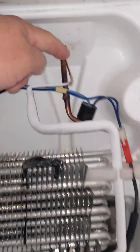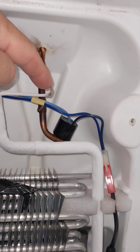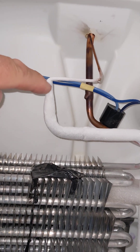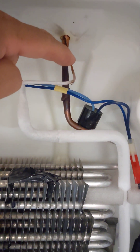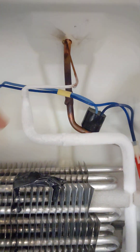Normally, this capillary tube will be free of frost and just be a copper line all the way down to the expansion area, which is where the line gets larger. And it's at this point when you would start seeing frost, when the line gets cold. But if you see frost in that skinny line, that means there's a restriction that's preventing refrigerant flow.